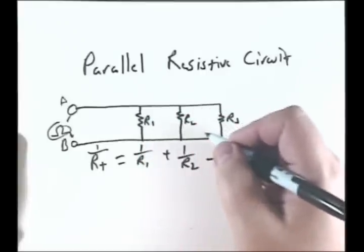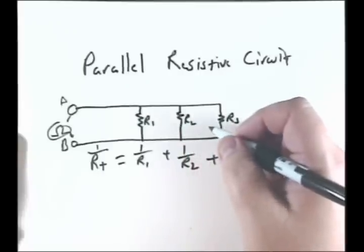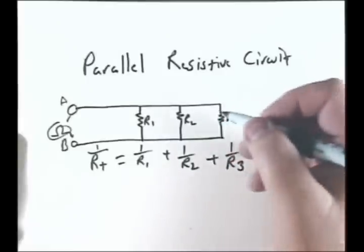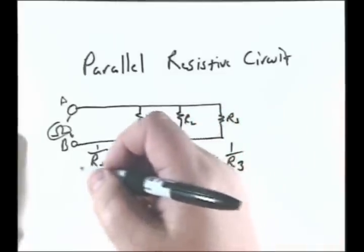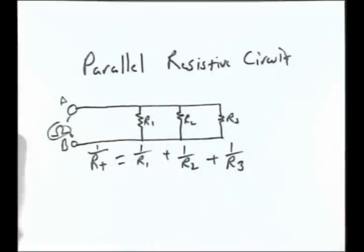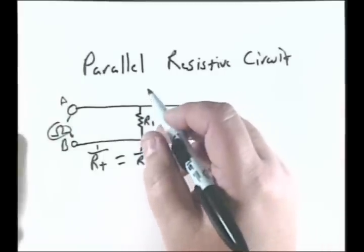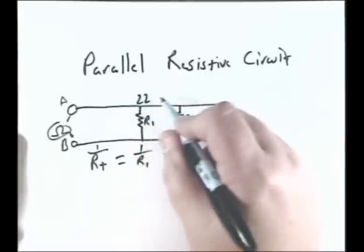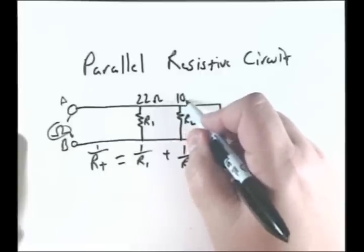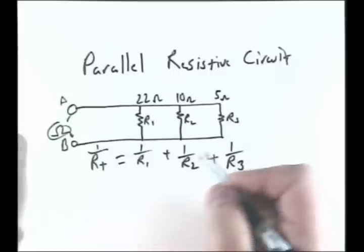We also have to remember that the total value of a parallel resistor circuit is always less than the value of the smallest resistor, and in a series resistive circuit the total resistance is always greater than the value of the largest resistor. Let's work this out for resistors that are not the same value: R1 is 22 ohms, R2 is 10 ohms, and R3 is 5 ohms — the same values we used with the series example.